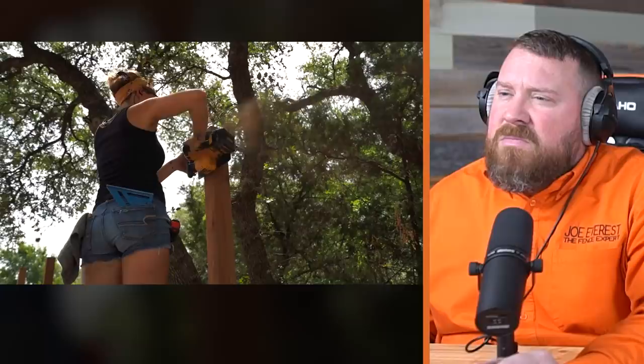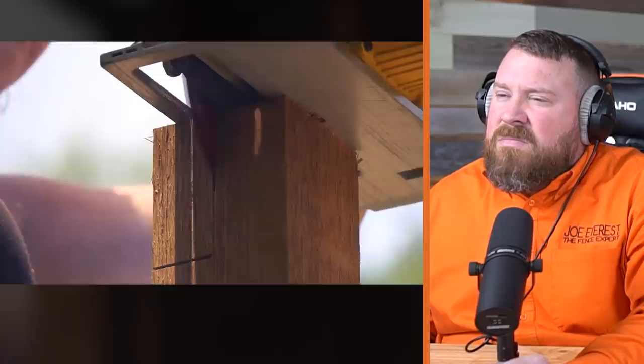It was, again, two cuts with the circular saw to make this cut. The first one was a plain horizontal cut across the face. Then the second cut was a vertical cut along the top end grain. And don't be alarmed if your blade starts smoking some. Just take your time on the cut because it's really hard grain to cut through. I needed a bit more depth on this cut after going all the way across the post, so I used a Sawzall to finish off the cut on each side.